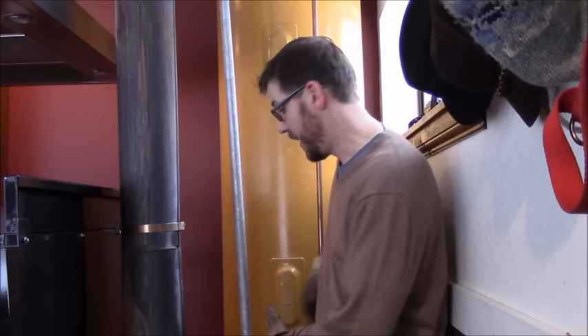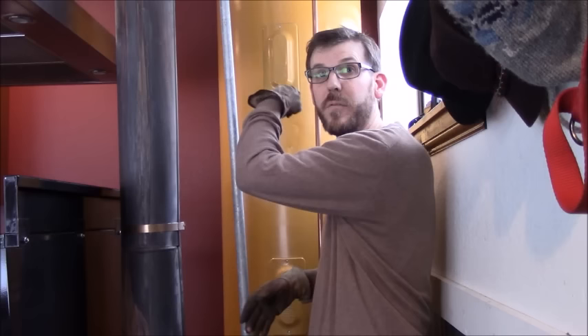On the backside of the wood cook stove you'll see our hot water storage tank. This is an electric water heater repurposed just to store hot water — it has no electricity to it whatsoever. The reason it's in the kitchen close to the stove is to use thermal siphon, which is a gravity feed system. Water drains into the wood cook stove, heats up through the water coil, and the hot water is sent out and up to the top of the tank.